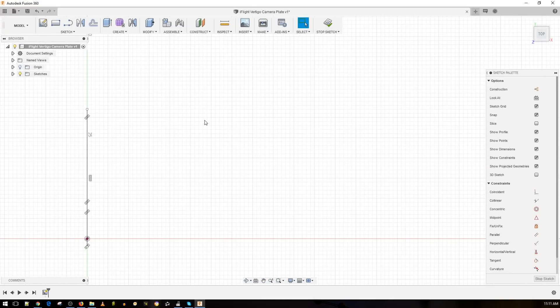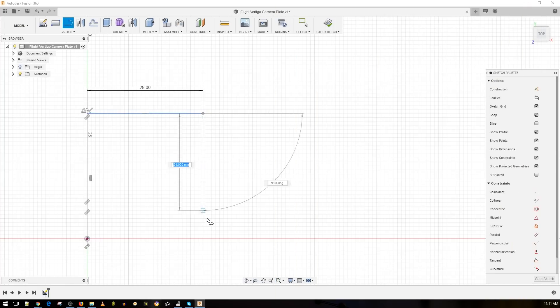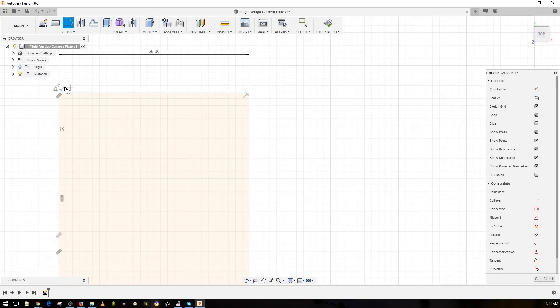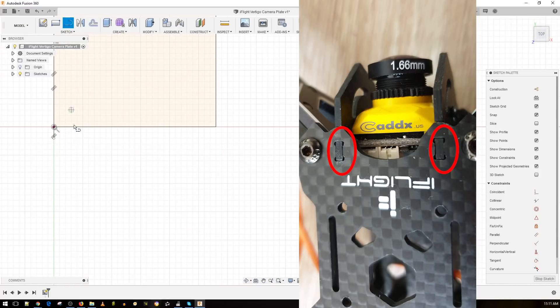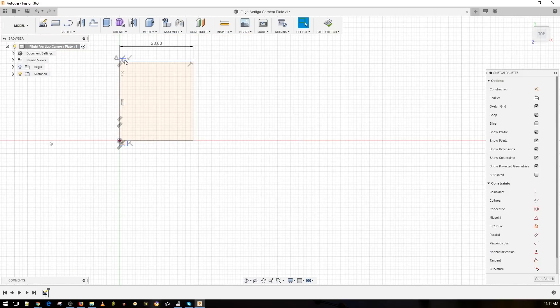We need to span at least around 28 millimeters from the back of the first tab going to the front frame. So we want to take from the bottom tab and go around 28 millimeters. I'm going to start with a basic square design just to get a reference. Right here would be the tab that goes in your upper frame — it's not the exact size but it gives you a reference. These go into the upper top plate, and this goes into the bottom plate. That's what's going to hold it, so we'll go out around 28 millimeters to protect the camera.